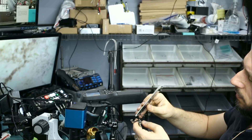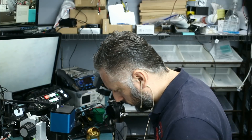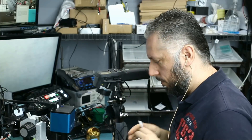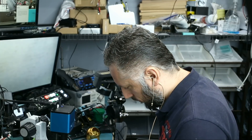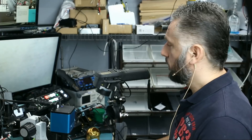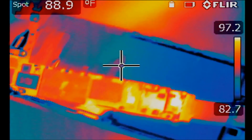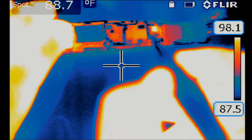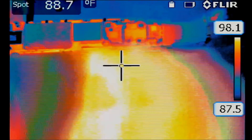Let me plug the screen onto the motherboard and see how the phone is behaving. According to the meter the phone is not booting up. I'm going to plug the screen in and connect the meter onto the board again. The phone is not powering on — let's take a look at the thermal cam again. It looks like the Tigris chip may have something to do with this, so let's go ahead and replace it and see if that will solve our problem.